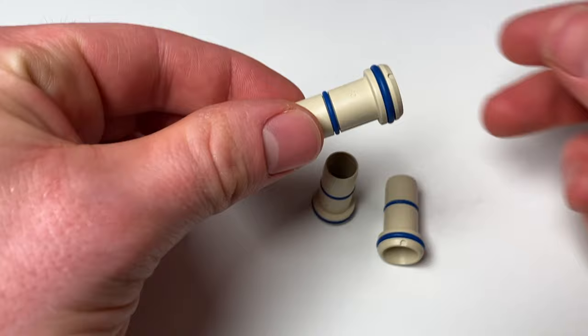Inserts also minimize any loss of shape of the pipe when you've cut it. They give additional seals, so you've got three o-rings keeping the joint watertight rather than just one if you haven't used the insert. The inserts also help make the pipe more rigid, reducing the chance of leaks when a force is applied against the joint. It's also worth noting these inserts are suitable for not only central heating systems but hot and cold water as well.